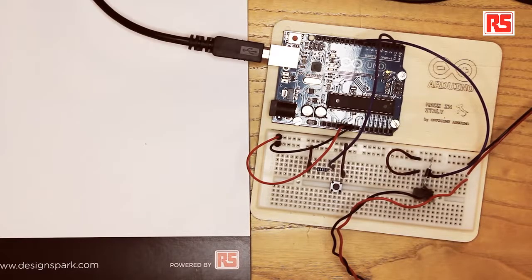So what are the issues that we have to take care of? First of all, the DC motor here works normally at more than 5 volts, which is the standard voltage that the Arduino operates at, and requires more current than a single Arduino pin can provide. Normally, we can just hook up a regular LED to an Arduino pin because the current the LED needs is low enough to power it with an Arduino pin. But the DC motor requires a much higher current, and we risk burning the Arduino pin if we hook it up directly.